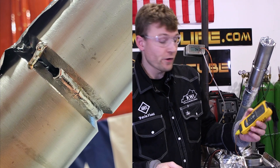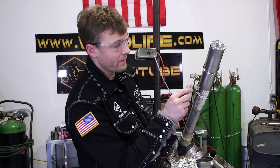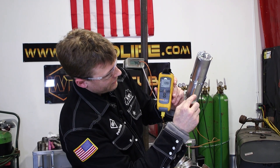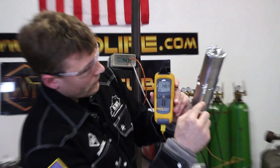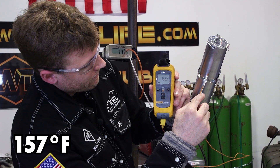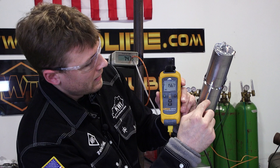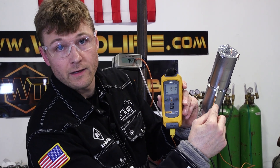For the fit-up I'm using a 1/8 gap, so if I use a 1/8 tungsten held in the middle, I have enough surface area where holding in the middle will melt the top bevel edge and the bottom bevel edge at the same time. My only concern is just moving in this direction and making sure I have a nice keyhole. I'll take a look at the tip of the filler metal — nice and silver — that's an indication that inside the root it'll be all nice and silver too. I looked at my deposited metal through the top; I can see everything is nice and silver. I'll count seven seconds — one, two, three, four, five, six, seven — then ease off and look at the deposit to make sure it's all perfect with no heat tint. The Fluke Thermometer tells me how hot this material is. The interpass temperature of titanium is 200 degrees Fahrenheit; checking one inch away, I'm at about 156–157 degrees Fahrenheit.